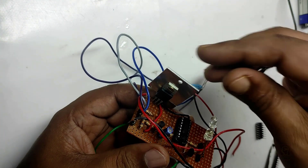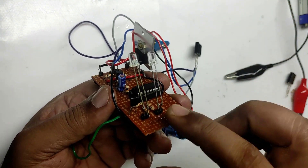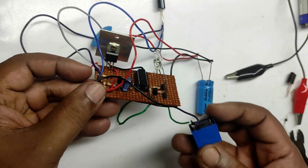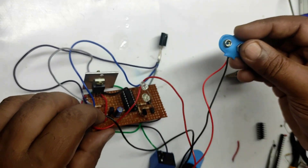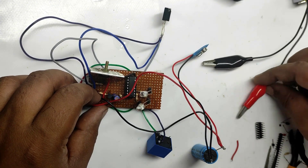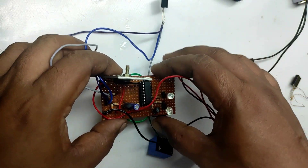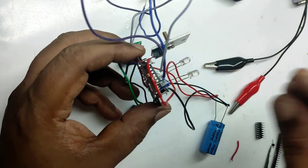The assembling is not very tough. This is the 5V regulator IC and we have temporarily connected the LEDs directly. We have connected the 12V relay also here. This is used for filtering the input supply. While testing during assembling, I used a 9V battery but now we will be using the 12V adapter. In the assembled one, I didn't add some filtering capacitors — I will add those later. I will explain the connection pins now.